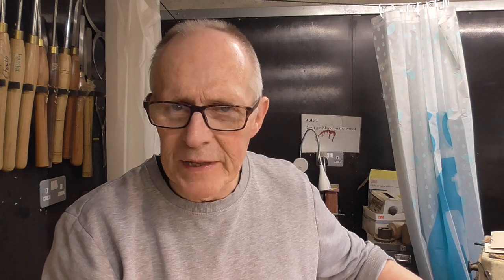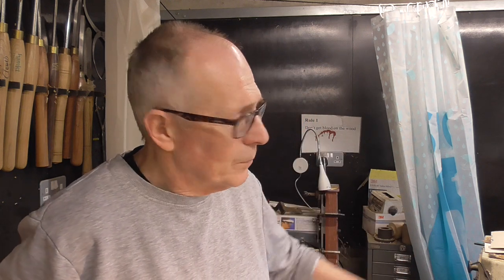The critical part now is making it thinner, but what's really good is I've stabilized all those knots with super glue - on the inside as well. As I cut down the inside I put more super glue in, because I don't want to see a knot flying out and leaving a hole in the side. Everything's pretty stable and sound. That was really my only worry when I started to hollow - that I'd find something horrible inside. It's going dead on. This is larch by the way - Ricky was here and identified it from the bark. I'm not very good at identifying wood. Sorry there have been no videos for the last few days, I've just been up to my eyes with other stuff.